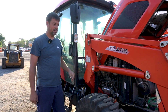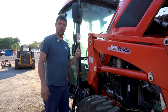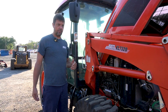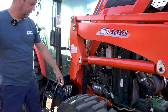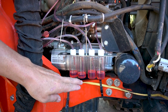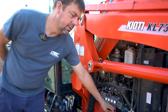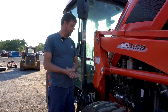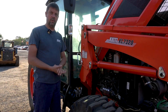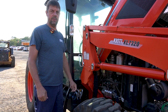After our dyno test, the engine operated at normal temperatures. We cut the AC on, ran the horsepower up to 65, let it run for five minutes, hooked up the bottles, and watched the fuel overflow. As you can tell, these two are just below three — two and a half to three — and these are up around three and a half to four. It shows that the front two cylinders are saturated with fuel. The fuel return line is dumping in, showing that the front fuel injectors are overfueling. So at this point, we'll replace the two front injectors.